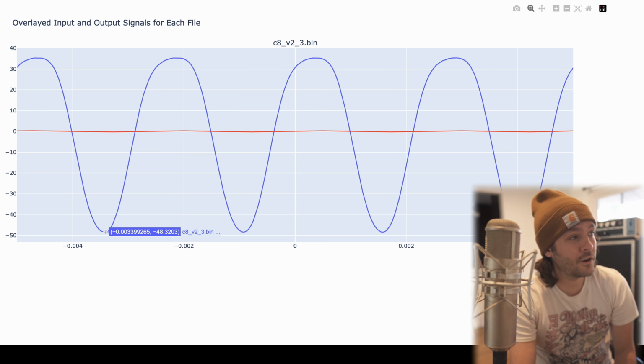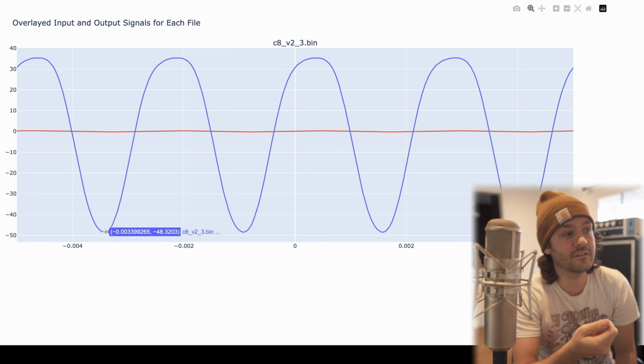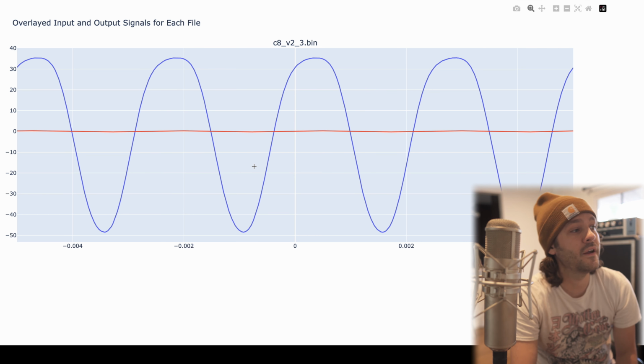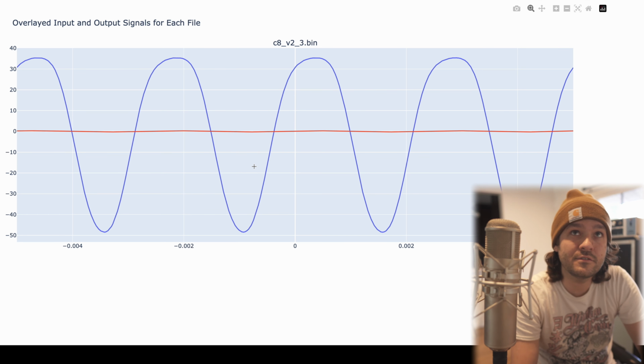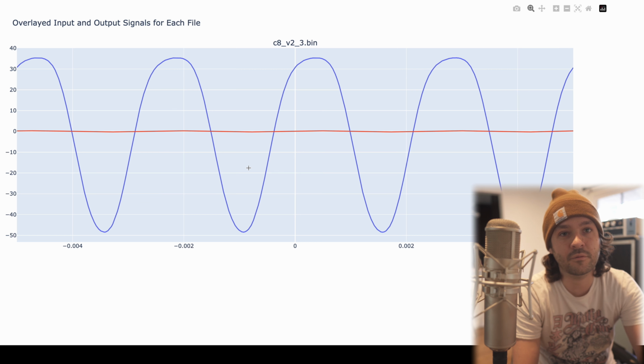That signal is always present on that volume 2 pot. And depending on where the user sets it, that's essentially setting the final output of this massive signal, right? It's almost plus minus 50 volts. But what's interesting is we've hit two tubes already. So our sine wave has been inverted twice. We're back into the correct polarity, but we got all this asymmetric clipping going on from the tube.